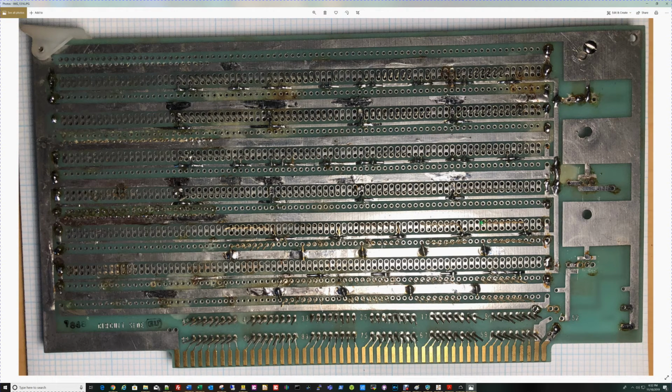That way I can remove that wire wrap if I decide to reconfigure the card, or if I need to use those inputs for some other address decoding scheme. So only really the power pins are bent over and captured here. Is this the best technique?